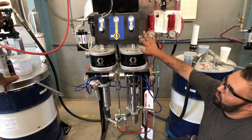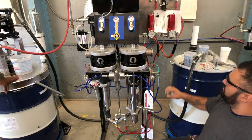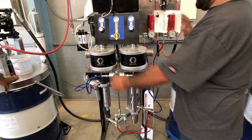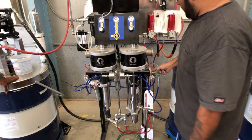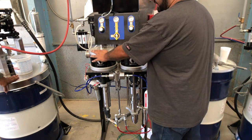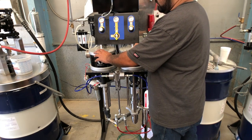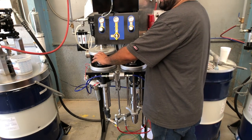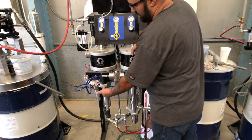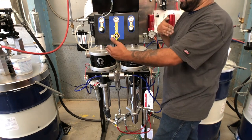Make sure there's no pressure at all in the system. Take that off, clean the filter, and put it back on. As the system is proportioning, it's actually actuating the dispense valves back and forth — four parts for this side, measuring every pump stroke. So four inches would be 80 cc on A, then it switches over to B and dispenses 20 cc. That's how you get your 4-to-1 ratio.